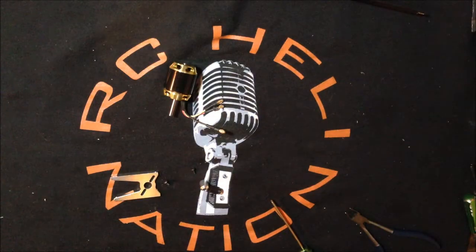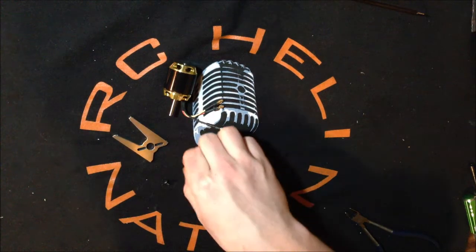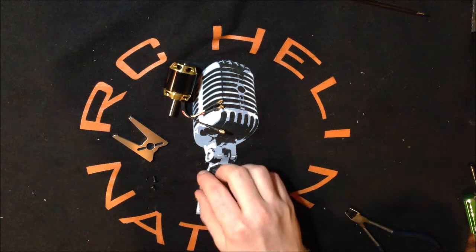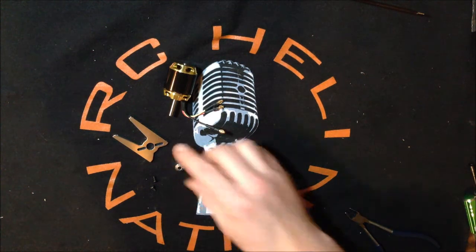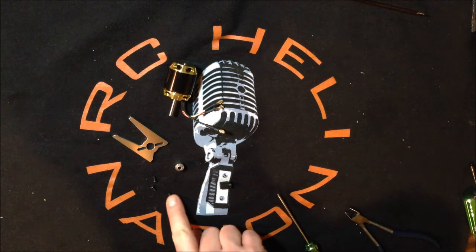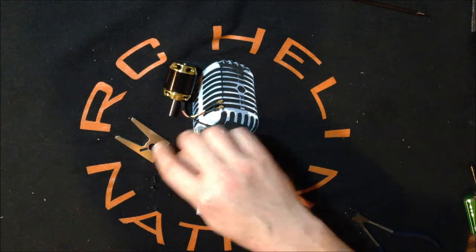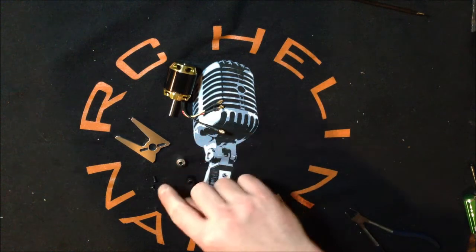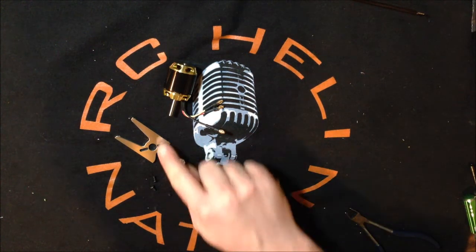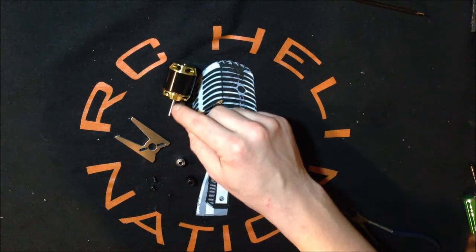So all those parts we have out here ready to go. We've got the mount, got the two screws, I've already cleaned those off, got any grease off of those. Here's the centering tool, pretty simple. I've got this little grub screw, clean that off, and our pinion. So just like I described it, put that on there, use the centering tool, tighten these guys, put this guy on, make sure there's 0.5mm between that and this, and then use the grub screw to screw it on here.